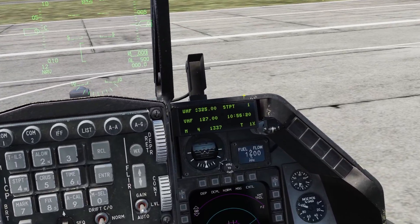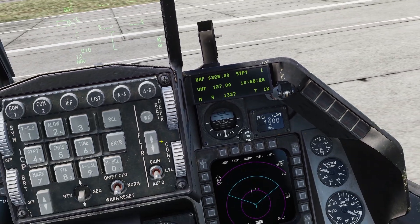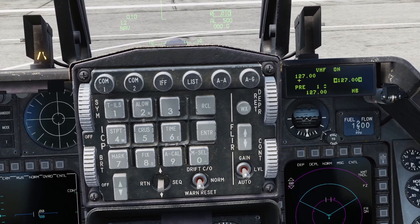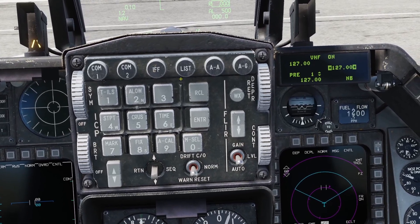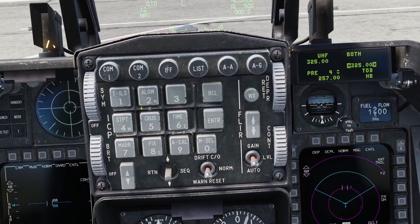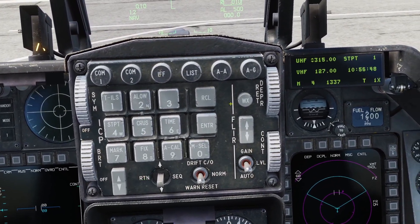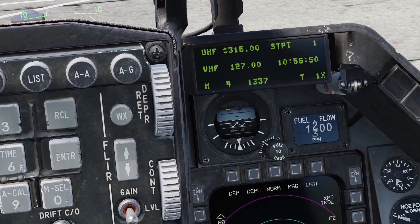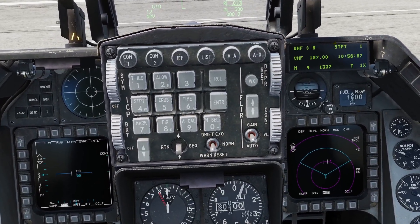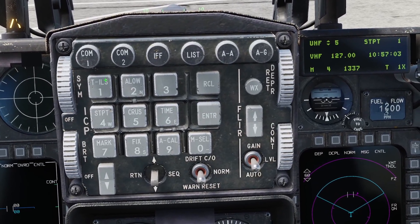You can control the radios with this computer right here. You can see what your UHF and VHF are tuned into. If you press COM1, you can enter the UHF menu, and COM2 is for the VHF menu. Both menus work exactly the same way. Right here is your selected frequency, so you can dial in whatever you want and click enter. You can also enter a channel — for example, click channel 5 and click enter. You can use the rocker switch to quickly change through your channels in the main menu.